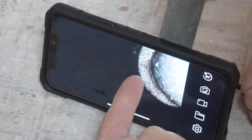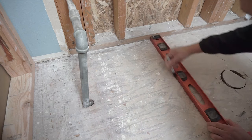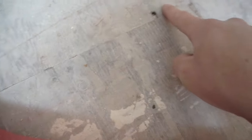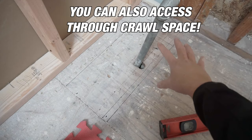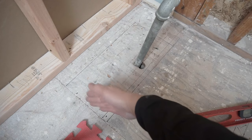You can see where the insulation is, and we can actually go disconnect this fitting right here. I like to use this for finding studs, so we're going to find the joist on the bottom. Here's another trick: there are two pieces of plywood butted together where they nailed it, and we can see nails right there. So we know there is a floor joist running right through here, right beside this pipe. We actually drilled right through that floor joist. Both of them sit at 16-inch centers. Where I'm going to make my cut, I went past the joist so that when we put this back we have something to screw into.